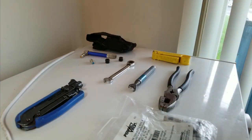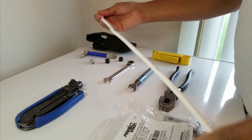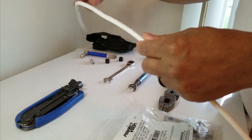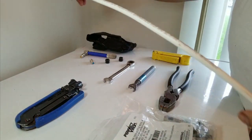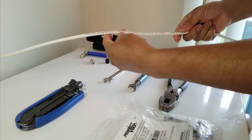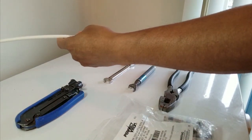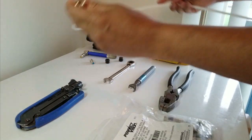I'm going to show you how to repair a damaged coax slash cable line. You can do this for one that's outside or inside your home — it's basically the same process. You've got your regular cable line here — RG6 is what most companies across the country use. RG6 cable wire, similar connector here, and I've got a little cable already cut.